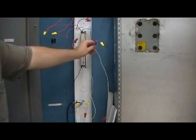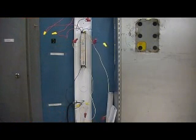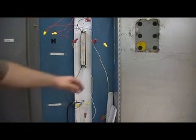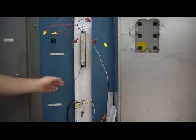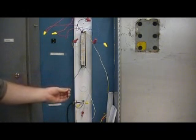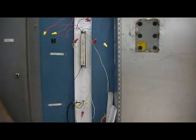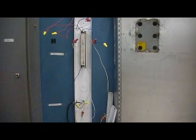And your other yellow wire to your other yellow wire in the light. So all this is is matching wire colors — that's as complicated as it gets. White to white — neutral. And if you were wiring this up hot, your black would be the last thing that you do. That would be the last connection you'd want to make — actually wiring up those two together. You want the hot to be your first and last connection.